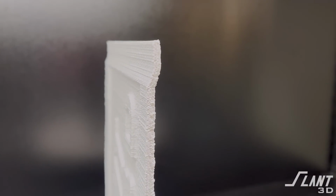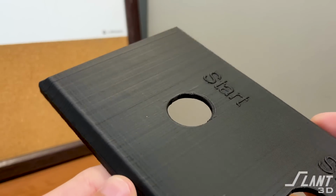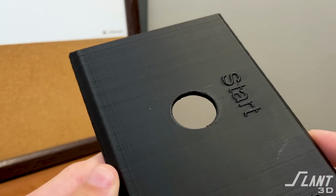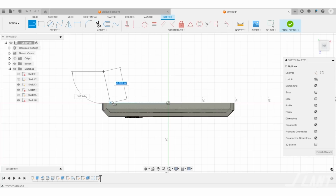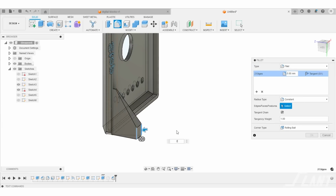That being said, you never want a tall part because as it grows, it can cause little amounts of warp. And you can actually see that appear on some of the prototypes that we've done. Here's one where you can see some of that Z banding, which is from the part warping and bending as it goes up. So in order to reinforce this part, you actually apply some feet to the bottom. This makes sure that it can't fall off and that it doesn't warp or deform.